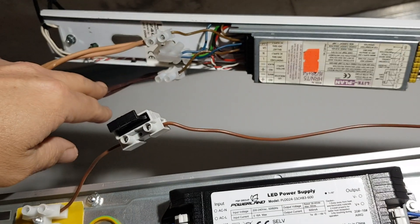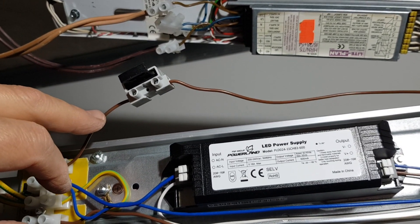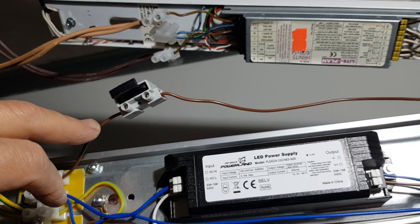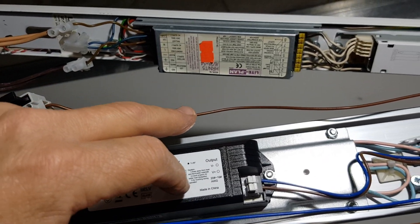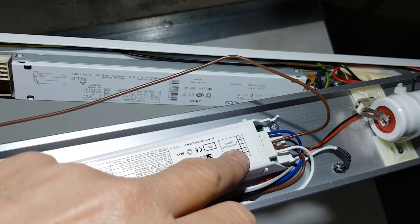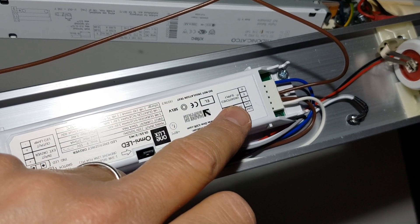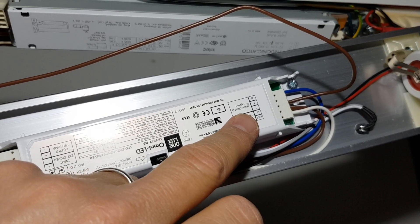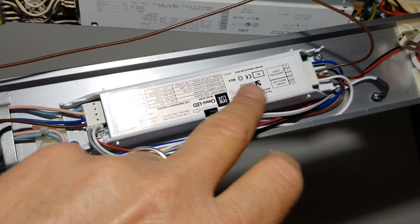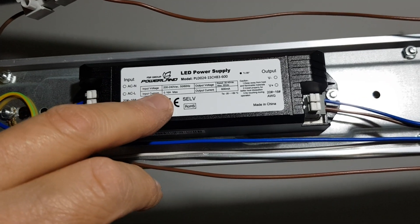The dark brown is connected to this wire, which is the emergency light switch power, which comes all the way to the unswitched live side, and in turn this powers the LED power supply.